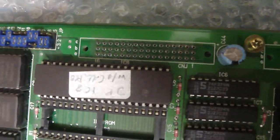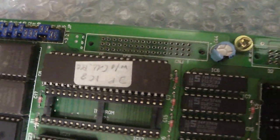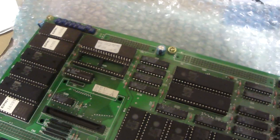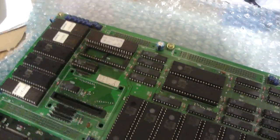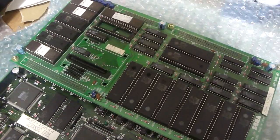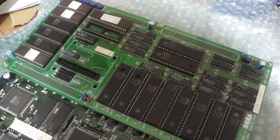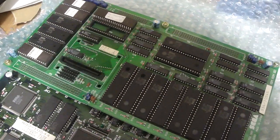The first thing that you're going to want to do is take a look at IC8. This is a 16-bit 40-pin EEPROM. A great guy by the name of Krejci123, a YouTuber, was able to figure out the problem with this EEPROM. The main problem with this board is that since it came out of a cabinet with a hydraulic setup, the hydraulic system needs to be connected in order for the game to start up. So without doing any manipulation to this EEPROM, the game will sit in a loop saying that the drive board is bad.